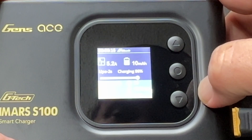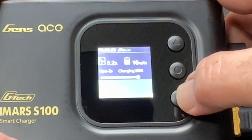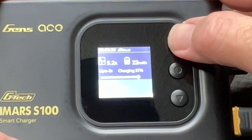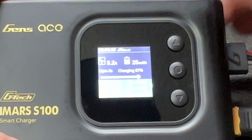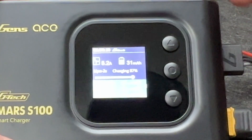There's your charging, there's your cells right there — it knows the battery. There's your 18 cycles on that, 5200 milliamp, 5.2 amps — that's a 1C charge rating right there, by the way. So pretty much you get to walk through everything: overall battery voltage, everything. It's all in that plug right there, and you can change this plug out to whatever you want using the adapter.